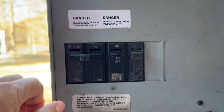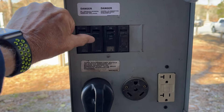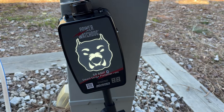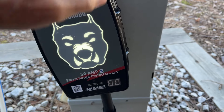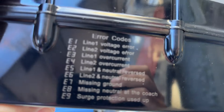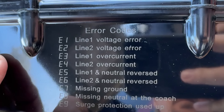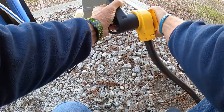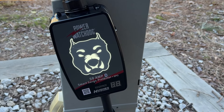The first thing I want to do is turn the breaker off, then plug in the surge protector, and turn the power back on. With the face white, it means everything is okay — no issues — you hear the clunk. Had the face been red, it would have given me a code right here, and then you flip it over on the side to interpret what the code means. For example, E1 is a line one voltage error — you can see all the codes there. Not that you can fix them, but at least you can tell someone what's going on. We're in good shape, so I'll turn the breaker back off, plug the RV power cord into the surge protector, and flip the power back on. The face is still white — listen for the clunk.